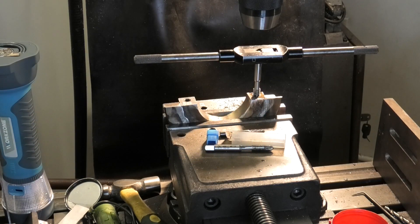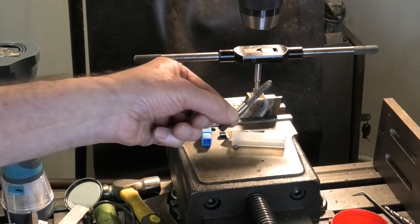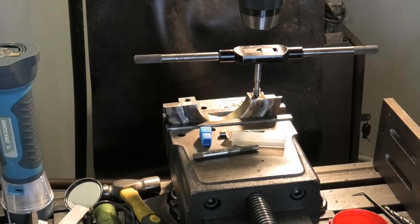It was drilling slowly but successfully with just hydraulic oil for lube. But I actually decided to give it a try halfway down dry, and immediately the penetration speed just doubled. So it wasn't actually drilling - it was thermally failing the workpiece. Drilled it out. We then used a gun tap - this fellow, as my suggestion. Got about halfway down the hole and it just started to jam. Not worth breaking a high speed steel tap in there.